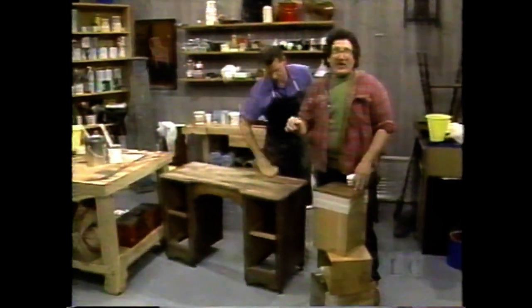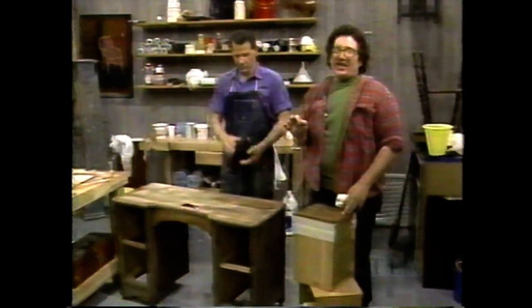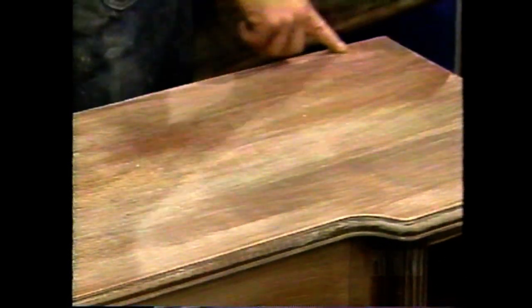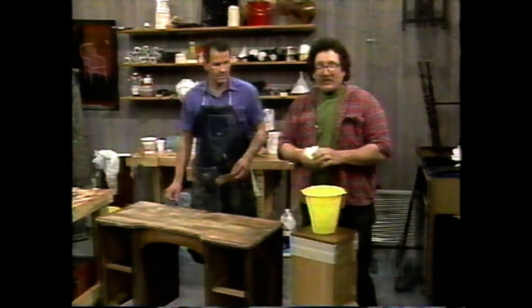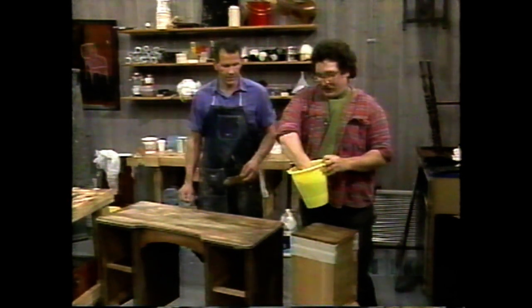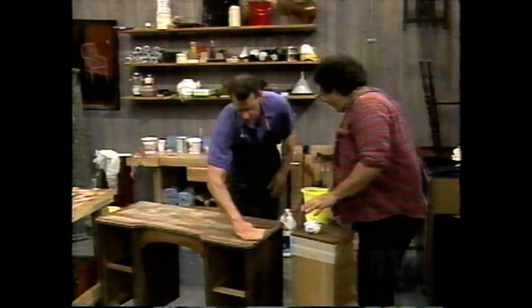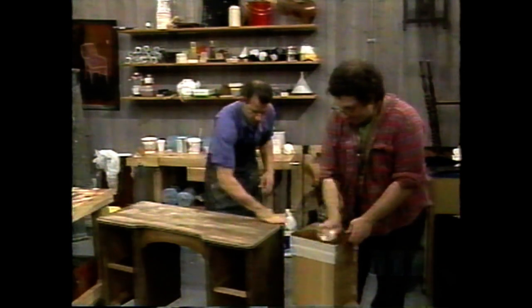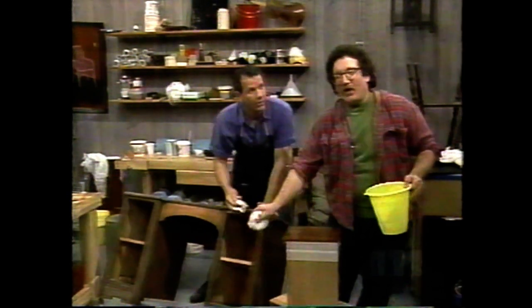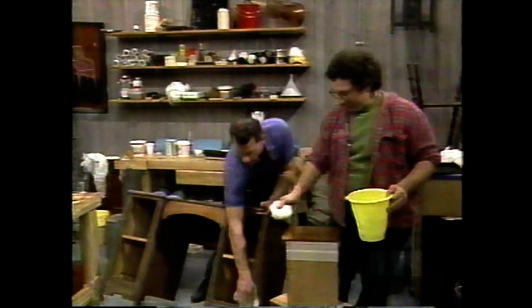Before we start painting or mixing our paint, there's a three-step cleaning-down process. First is sanding — I'm sanding with 100-grit garnet paper. The finish on here is a shellac finish, and I'm sanding it down. There are just a few veneer repairs that I already did. Next step is cloth and naphtha — naphtha is the cleaning agent that will get rid of everything in the cracks and crevices. Of course, you've dusted that off first. The prep time is the most important thing and it often takes more time than anything else.